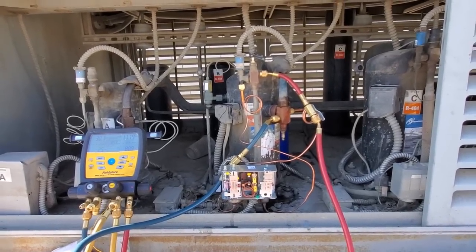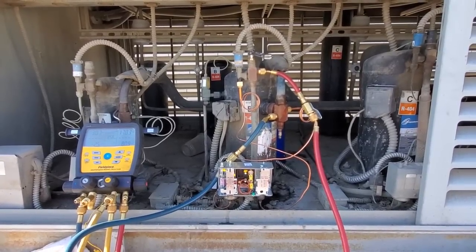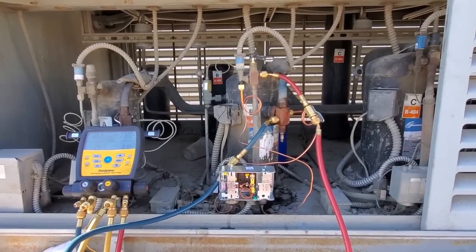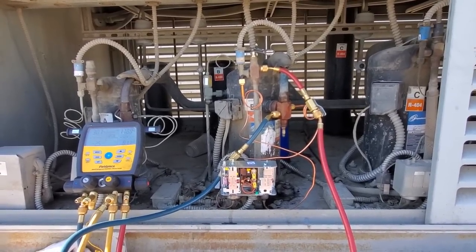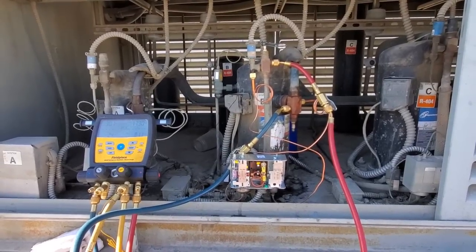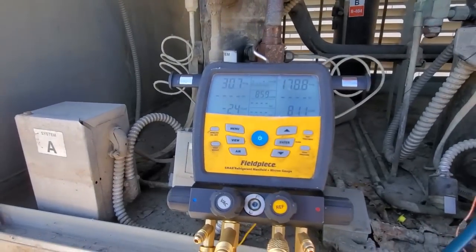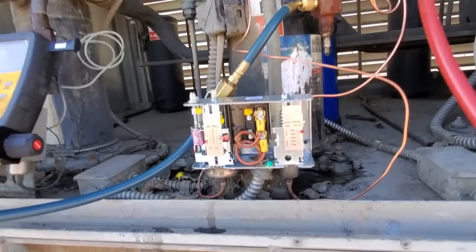If you do have hot pull-down issues where you have a heavy load on the compressor, what can happen is you can overload your compressor — it can run high amps, all kinds of stuff. That's typically seen in a situation where you have a freezer box that basically has hot product loaded into it. By putting the pressure-limiting charge on there, it's reducing the load. In a nutshell, if you have a pressure-limiting power head on this particular expansion valve, it's going to limit the suction pressure to about 30 to 35 PSI. Notice our standing pressure is about 30 PSI, and my pressure control is set for about 30 and some change.